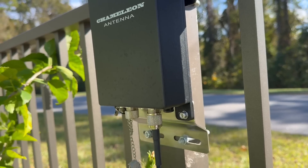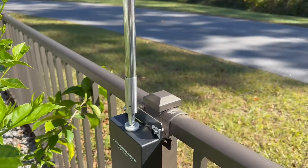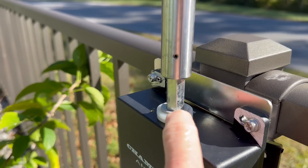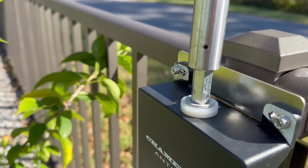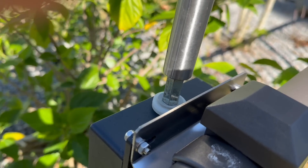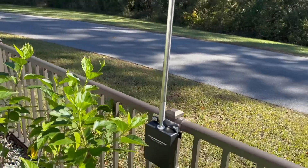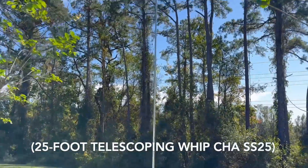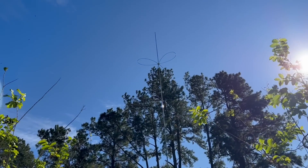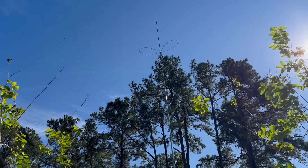What's very unusual about this setup — not only is it unusual in being used on an aluminum fence — but I have modified this area here, what used to be the beehive. I've modified it so that you could put a 3/8-24 thread antenna into it. And what I've got here is the Chameleon 25-foot whip, and then to make it even more unusual, I've got their capacitance hat on top.